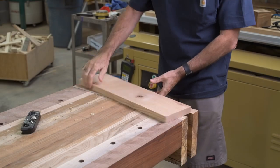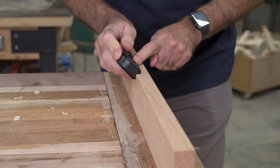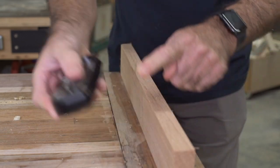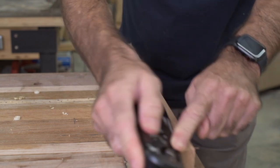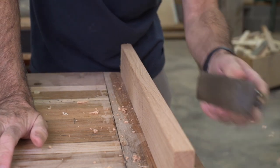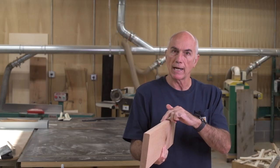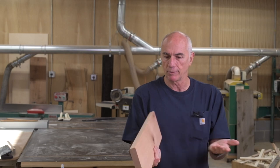I've got a piece of red oak ready to go, so let's give these both a try on a piece of wood. Let's try the round over first. With each pass of the edge trimmer, you lower the blade slightly to get the detail you want. And now I'm going to use the block plane to try and get the same results. Looking at the round over from the edge trimmer and the block plane, I really can't tell the difference. And if you were to pass sandpaper over it a few times, you really wouldn't know any difference.